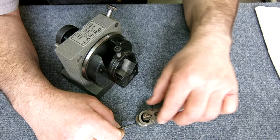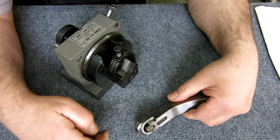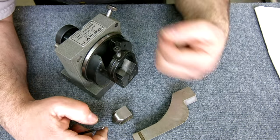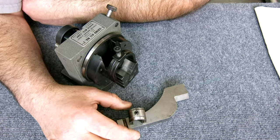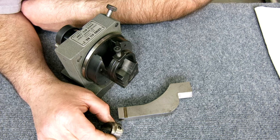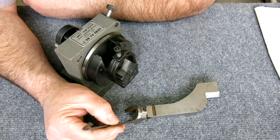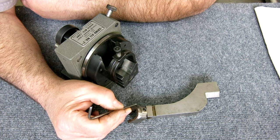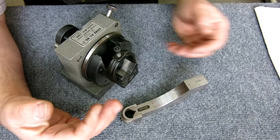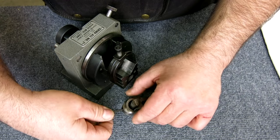What's going on here is he had this in the box just to keep the end keeper — so he didn't lose track of it and they wouldn't wander off. And this is one of the really neat features of this thing. Look what they did — we were talking about style points the other day. He took a ball end mill and came around with a radius and cut some of that material away. It's sweet — just a really nice touch. What this is, is a radius dresser for surface grinder wheels.